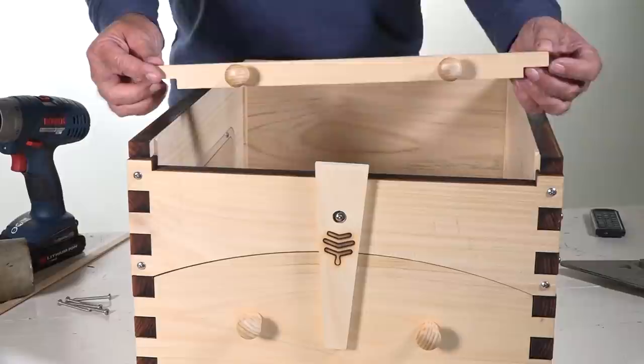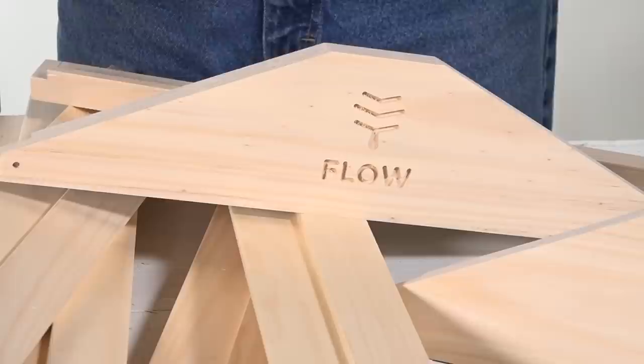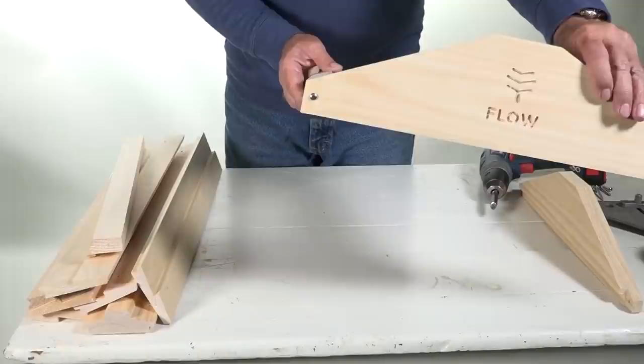Keep in mind, with this hoop pine you're going to want to put a finish on the exterior. I put Thompson's Water Seal on it, but you can paint it or use any exterior finish. Do not paint, seal, or finish the interior of your hives. Now we're going to move on to the roof — they have a screw kit just for the roof components.